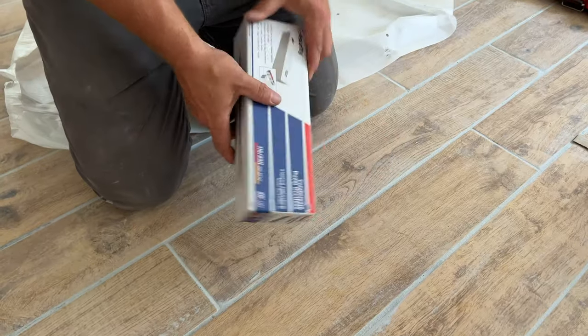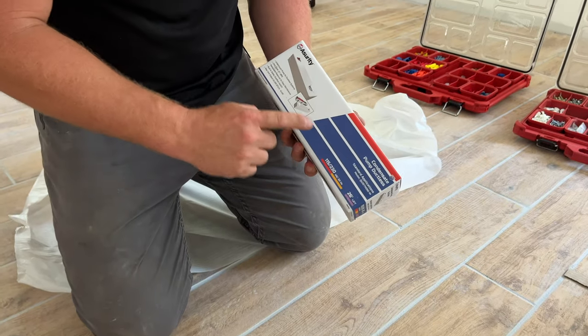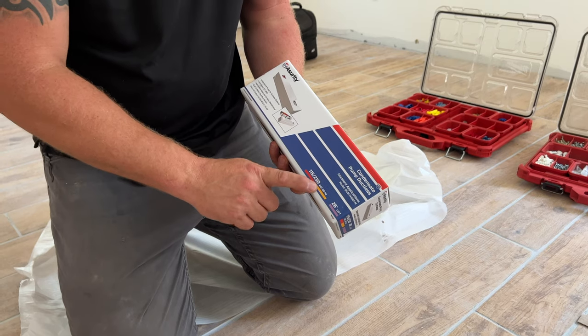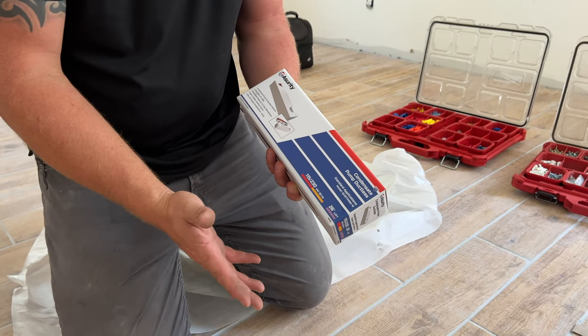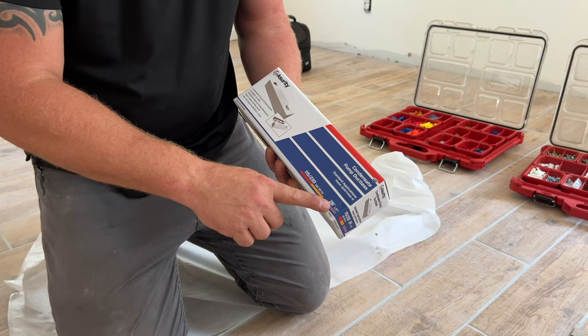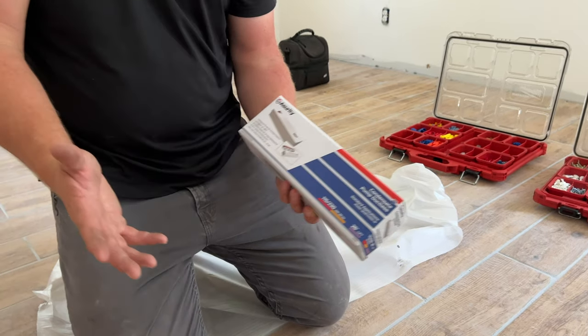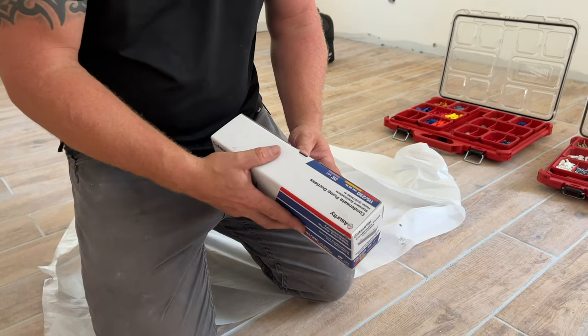All right, so the pump that I'm gonna be installing today is by Assurity. What's really cool about this one is it is multi-voltage, 115 to 230, depending on what kind of ductless unit you're working on. And this one's rated for 26 feet of lift. On this particular application, we have maybe 3 feet, so no problem there.